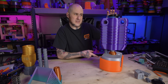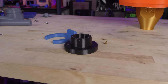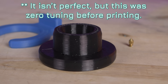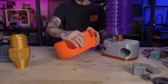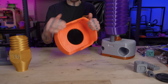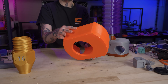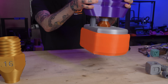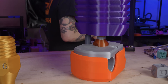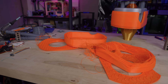The black piece that goes in the top for the Bowden tube coupler is 95A Overture TPU — the first flexible I printed on this machine, and it just printed well. Then I wanted to try something bigger: the silicone sock for the 1000% hot end, printed in Ataraxia's flexible PLA at 89A shore hardness — quite flexible, it really squishes and has some give to it. This was a real pain to print, but that was down to the material wanting to curl off the bed, not the Neptune 3 Max. At no point did the machine give me any trouble printing this material.